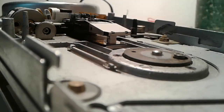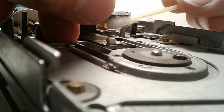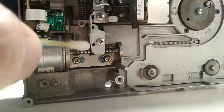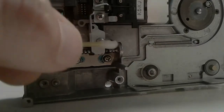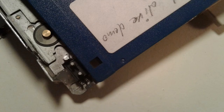Meanwhile, we can give some love to our floppy drive. We clean the read and write heads and the motor drive shaft with some isopropanol and lubricate the drive shaft with some oil or thin grease. Here's the new switch after cleaning it up a bit. The write protection hole of the floppy disk will align with the front pin of our switch. The rear pin will detect disk presence. This looks good so far.